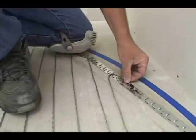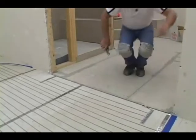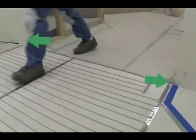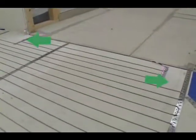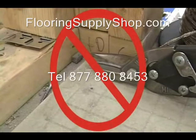At the far end of the room we are running short of wire, so we have to make adjustments. We'll reduce the heated area by eliminating wire in two places where people are unlikely to stand or walk. Then we'll add two short straps so that our wire will warm a walking path all the way to the entrance. There are many ways to handle excess warm wire, but remember that cutting the wire isn't one of them.